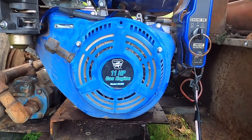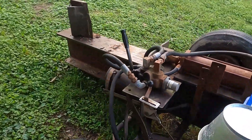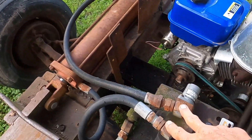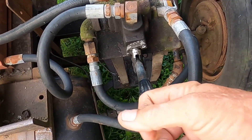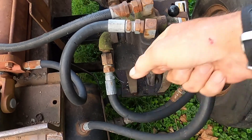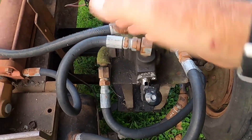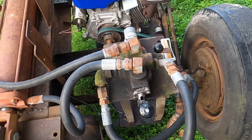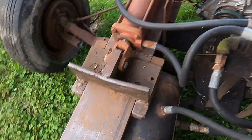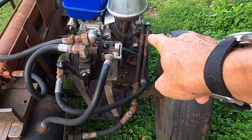We were honestly expecting this engine to just detonate itself, and at one point we thought it did. But what had happened was it's got the wrong control valve on here for a log splitter — should have a two-stage and it doesn't. So you pull it down to bring the ram down and it stays down instead of being spring loaded. When you're bringing it back up, once it gets back up, typically a log splitter will do that. This is a homemade log splitter, so that's all fine. Got it running, got the belt tension, and got it to where it would split about anything that we could put on there.